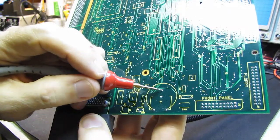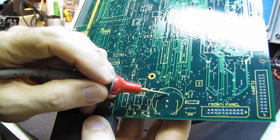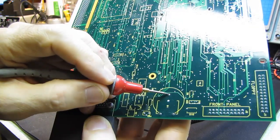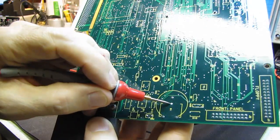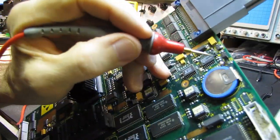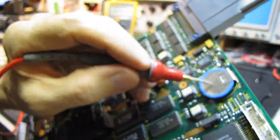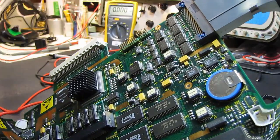Evidently you can use two different size batteries — they have a combination for two different sizes. My battery is using this one, as is the replacement. So I'll solder here because these two points are common. I'll put my negative here and my positive here, and then we can safely remove this battery and maintain the memories. Let me get that solder done.